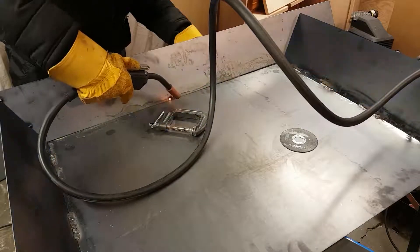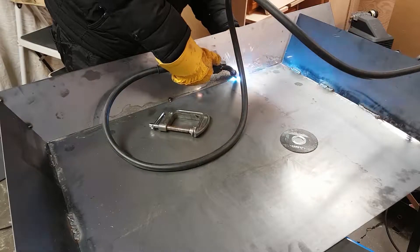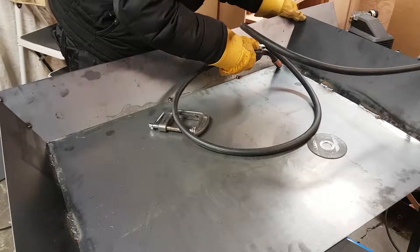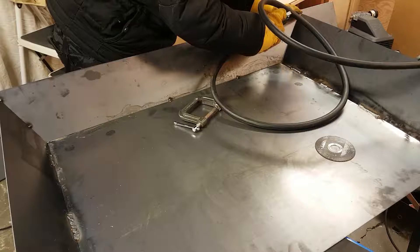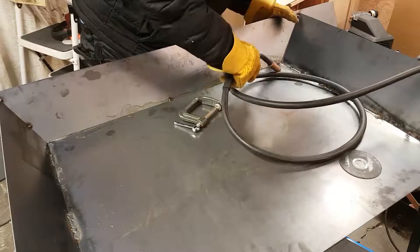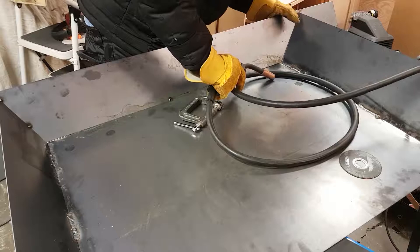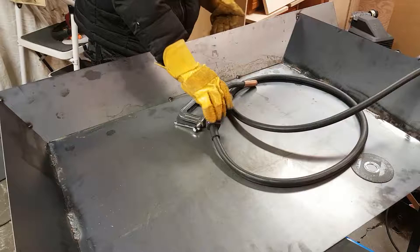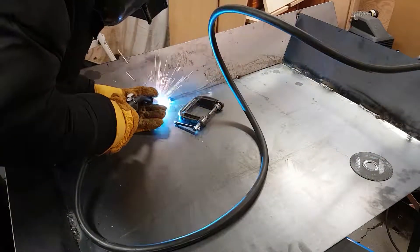To get the position of the parts just right, sometimes you have to hold on to the parts. And to position the gun and the welder just right, you have to hold on to the gun and welder and be able to see what you're doing. As a consequence, I'm using both my hands, so I don't have a hand to put down my old helmet. So I just use the safety squints and close my eyes — my face is still exposed. Not the greatest idea. I don't suspect this will be a problem anymore, as I recently got an auto-darkening helmet. So no more sunburns for me.